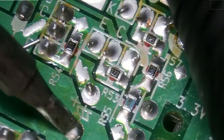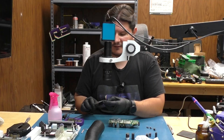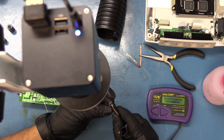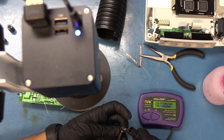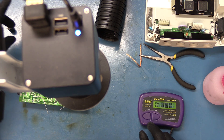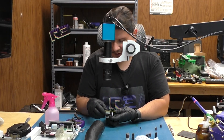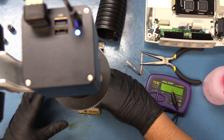We have two more to go — we'll go for the center one. Guess it's time to bring out the pliers; it came right out just like a tooth. We'll check out the ESR and capacitance: 569UF and 0.16 ESR. It's supposed to be a 10 volt 470UF, so it's definitely doing great and was not leaking. It's a much smaller capacitor so it's a little bit easier to work with in this already cramped area.